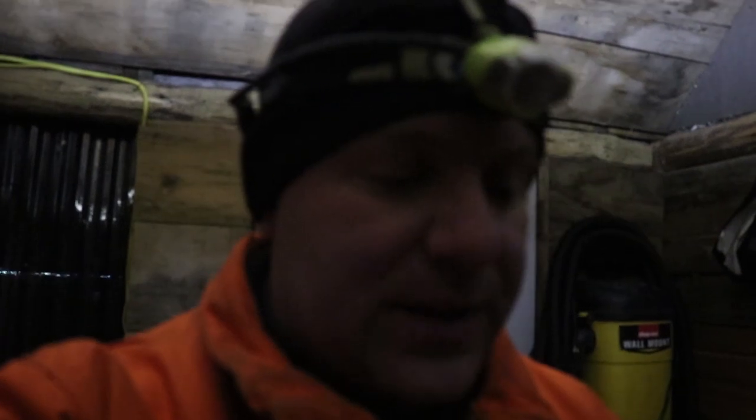It's about midnight, just getting home from other chores around town, and I wanted to check on these batteries. Alyssa got home earlier around 6 o'clock — the generator had been charging those two batteries for around 7 hours. She said everything looked good and voltage was good, so I had her turn the generator off and run them under load for a bit to see what would happen. It turns out they didn't do well at all — within an hour, the voltage had dropped to 11 volts from what appeared to be a full saturation charge. So I ran the generator for around 2 more hours to put a little juice back in them, and I wired them back into the battery bank — all eight batteries wired together for tonight.